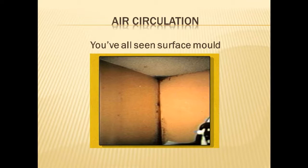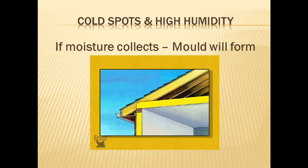Well, what I'm really talking about is a cold surface, whether it's just a line, whether it's a whole wall. The cold surface, the humidity for a long time, that's causing mold. So if we go to the next slide, which doesn't really show us a lot except you see the double header up there. I got lots of insulation in the attic. I got my insulation in the wall. What do I have? I got ventilation coming out from the soffit that's just pissing on that double header and going into the attic. So the double header is minus 28 degrees, and it's about 1.2 R per inch. So we don't have a lot of insulation, and we're right to the drywall, and you want to know why the top of that wall gets mold on it.